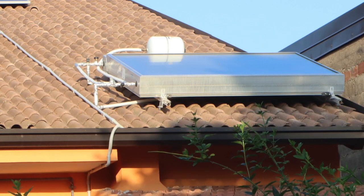It is a storage under a flat collector, which means it is very simple and no pump is necessary. The power of this solar collector is a little bit more than 2 kilowatt, meaning that each hour when the sun is at its strongest it will give you 80 liters of shower water. And besides the solar collector there is also another solar thermal system.